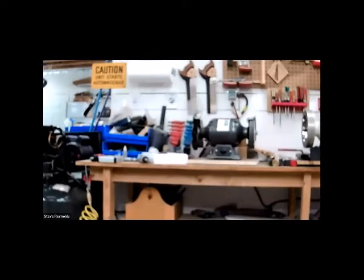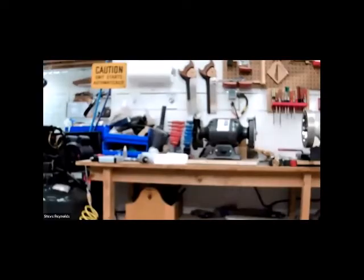Yeah. Particularly if I'm grinding the heel off a bowl gouge or something, the Tormek would make a career out of that. So as much as I like the Tormek for a number of things, it's not effective for high-speed steel a lot of times.